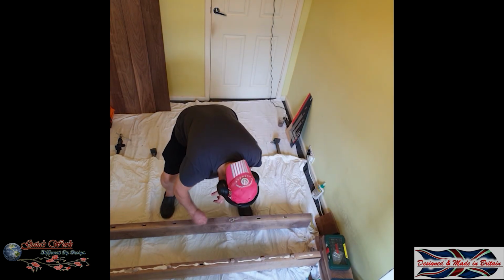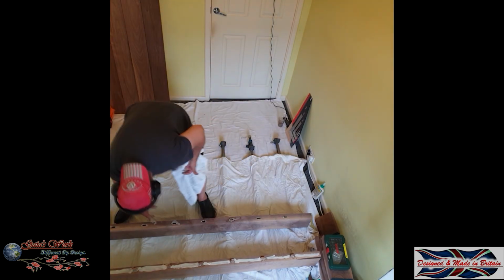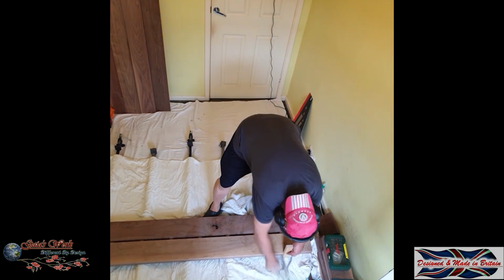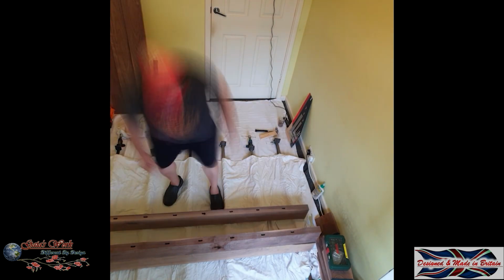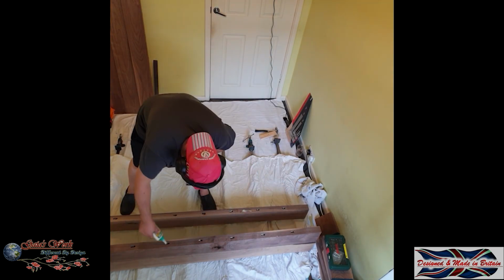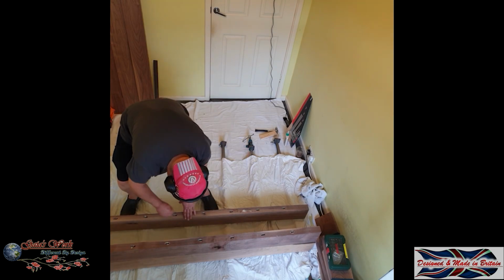Now, guys, I want everybody to pay attention and remember this is the most important part. If you make the slightest mistake in here, it will cost you the whole project. So take your time. Take your time. Make sure that they are all nicely and precisely placed. And as a trick, I put a little bit of water in the glue bottle, because all the glues now are made for faster curing, faster drying. So by adding a little bit of water in the bottle and shaking it well, when I use it, it gives me a little bit more time before it dries.